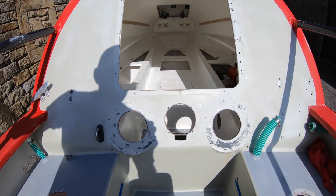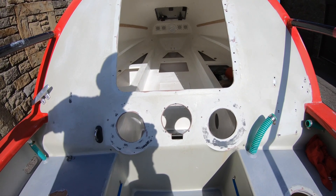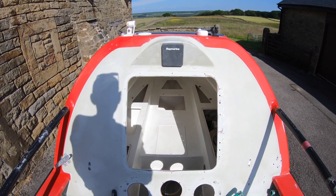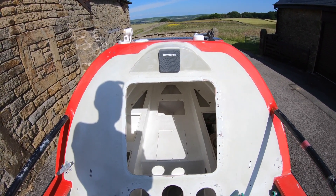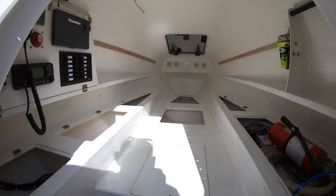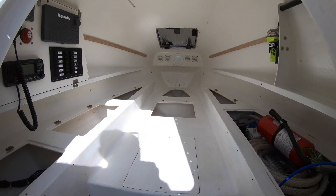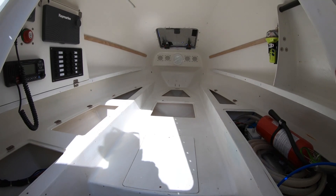The compass is obviously out — I can fit the cabling for the light for that. We took out the big cabin hatch, which was a real challenge to get out. We ended up having to cut the frame in a couple of places with the angle grinder, and again it was Sikaflexed in, so it was really challenging — but as it wasn't sealing properly it really needed changing. Inside the cabin it's been sanded down ready to start painting. A couple of repairs need doing first, but towards the end of next week I should be able to get the internal cabin painted and then get the boat back in the garage to start doing the deck and the hull.